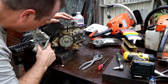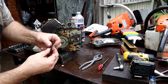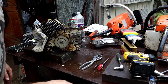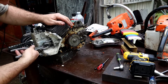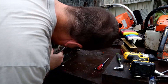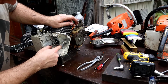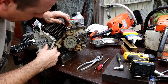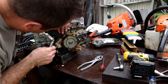My vacuum line is disconnected and broken. That's part of the problem with these older saws. Somebody was working on this one. Good thing I didn't go wrenching on that — this is actually well designed. There's a nipple in the back and just this little tube, which is easily replaceable. Really good design there.